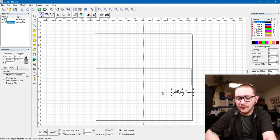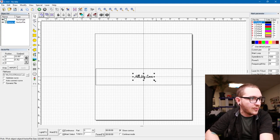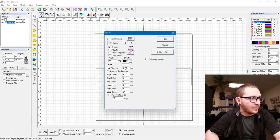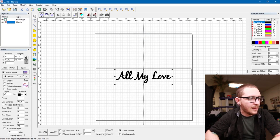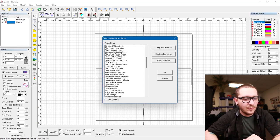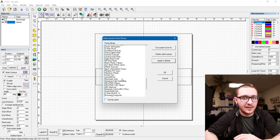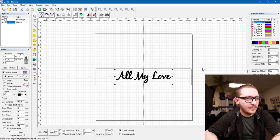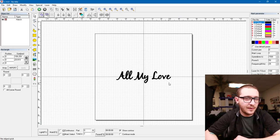Next, we've got our artwork in. We're going to center that up with Shift-C and get it to a good size. We can hatch it — standard line distance will be fine. Hatch one and hatch two, 45 and negative 45, just like always. Now we don't want to hit this too hard. If we engrave too fast, we'll scatter metal dust all over this frame which is going to scratch that mirror finish. So we'll start with a brass general setting at 1,500, 50, and 25, which should give us a nice coat on the metal where we can lay our steel white finish on top.